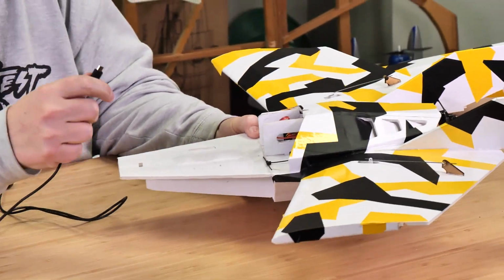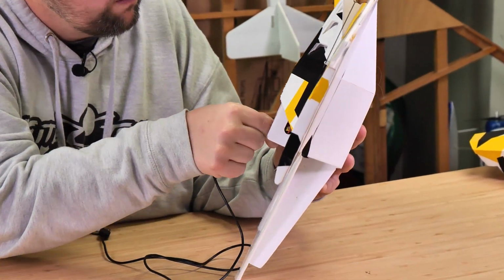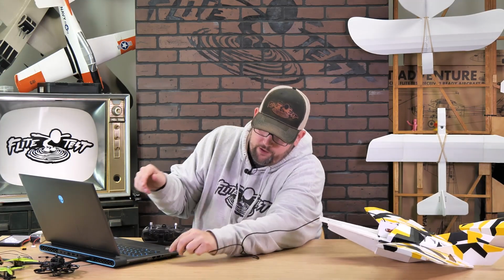Now we're ready to configure the Aura board to accept the Express LRS receiver. If this is your first time using an Aura board, please see the link in the description below on how to do the initial setup for an Aura board in any airplane. We're only going to cover the receiver section in this video. We're going to take our USB cable and plug it into the Aura board. There. And the other end we will plug into our computer, which has the Aura configuration software on it.